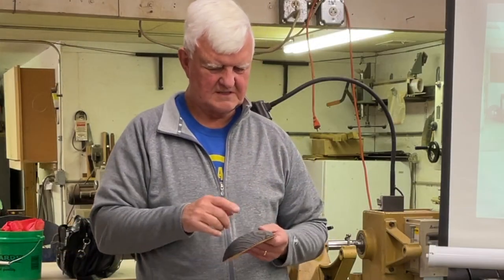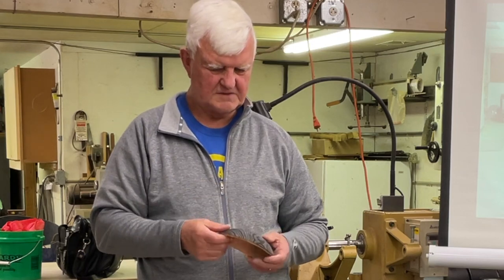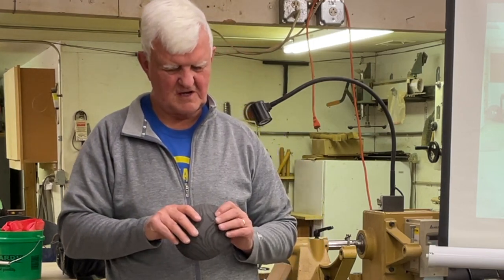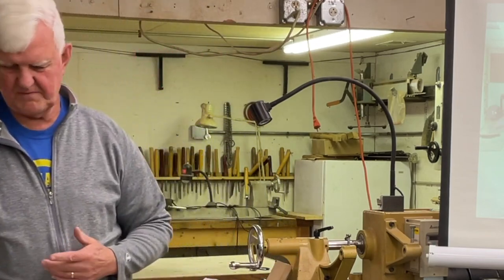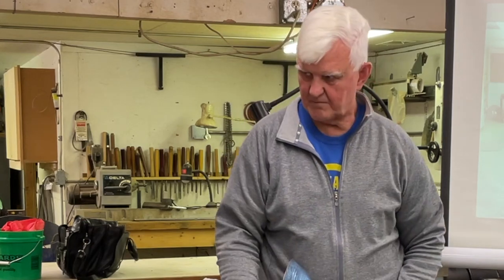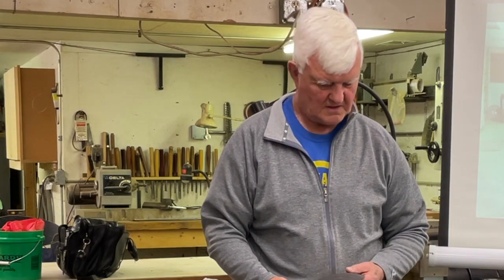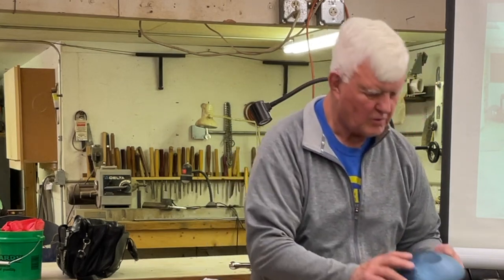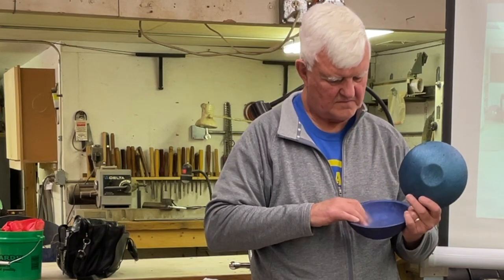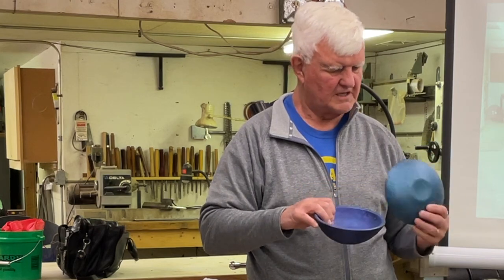When you feel this one, you can tell it's got some pretty deep grain texture. That was burned once — you can burn it twice depending on how thick it is. You don't want to burn through the bottom. The summer wood burns faster, not the winter wood. This one is oak, and this one is ash — both fairly tight grain. The elm grows faster, so that summer wood burns deeper on that. The grain in the oak is too close together, so these don't make quite as attractive a result.